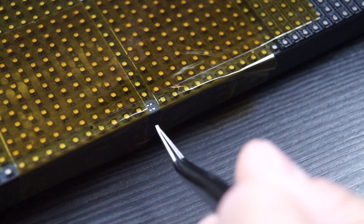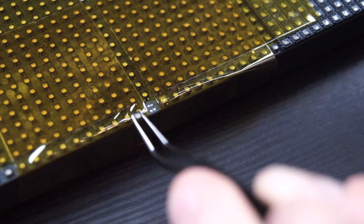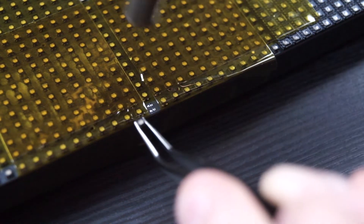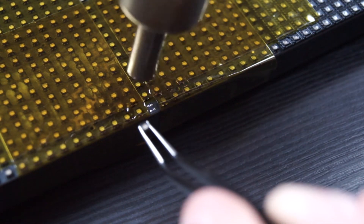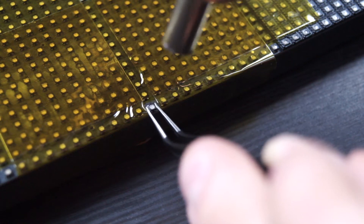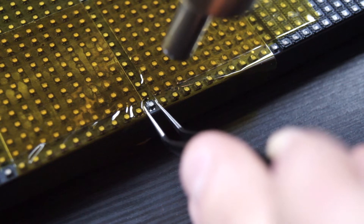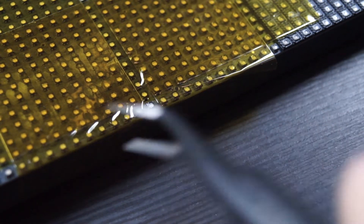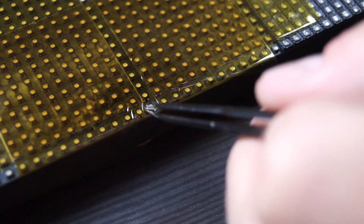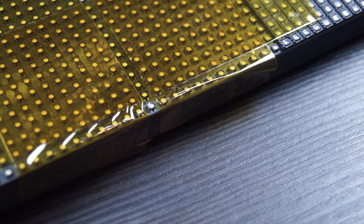You have to be really careful not to let the LED fly away — I nearly lost it already. I'll preheat the PCB a little bit first, then gently place the LED on top of the pads. After soldering it in, it's not looking too bad.